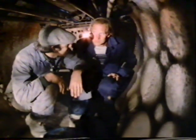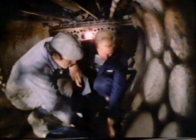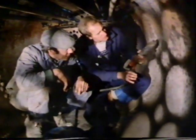The job we've got to do is to try and clean this scale off the inside of the boiler barrel. It's like an old kettle, really. We've already taken three barrelfuls out. Good grief. So this is the needle gun that we use to get it off with. You just press that — that's right. That's pretty good, isn't it? It is, yeah. Have you got any fillings?